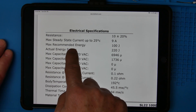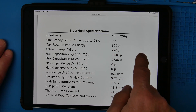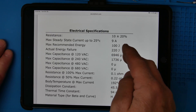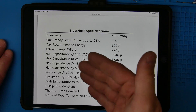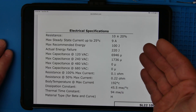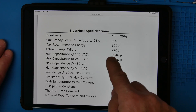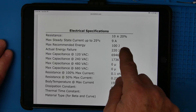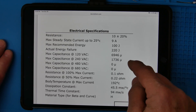The recommended maximum energy is 100 joules. Joules are like watts with time taken into consideration — watts are basically joules per second. So if you had 100 joules in one second, that'd be 100 watts. The datasheet says it's actually going to fail at 220 joules, so they want you to derate it to 100 — stay well beneath the actual failure point.